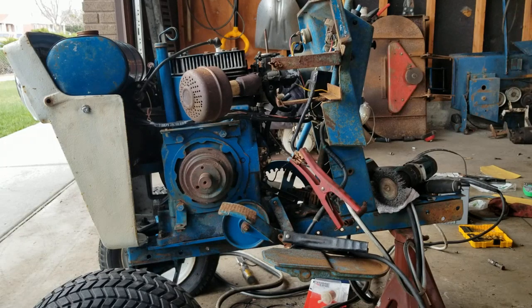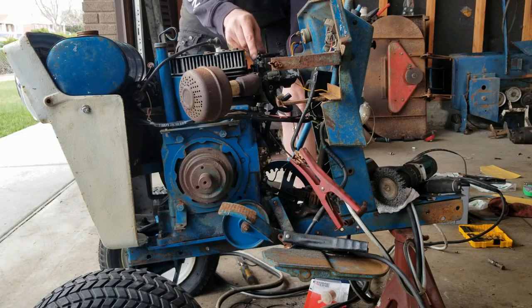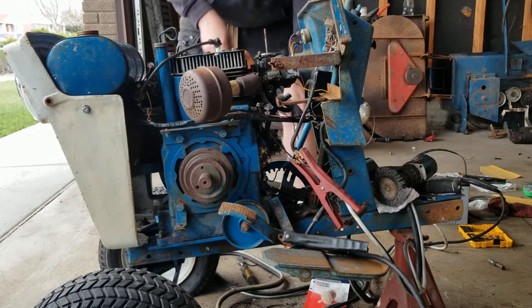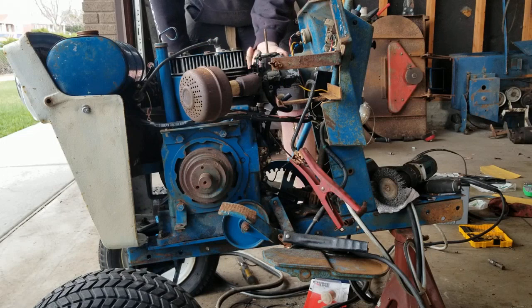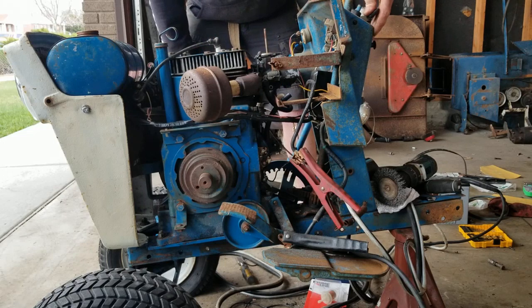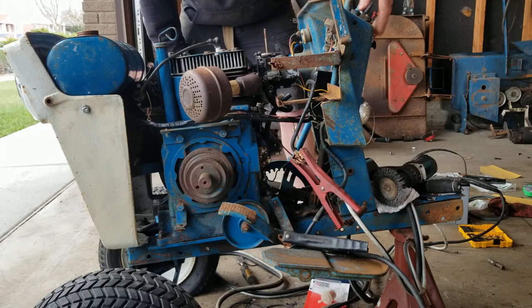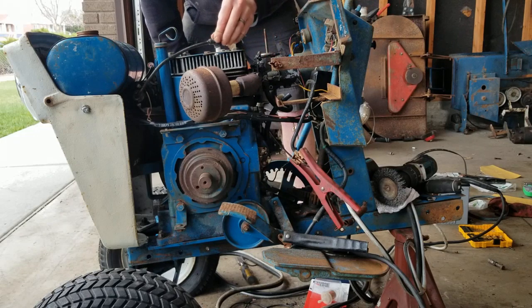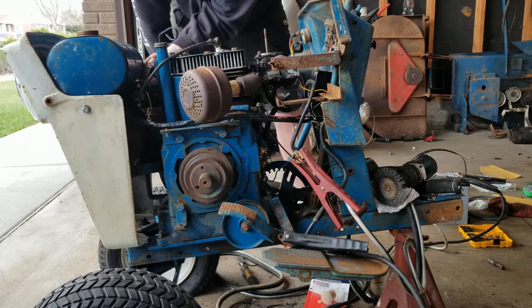Okay, hopefully this starts. We've done two turns back on the idle, two turns back on the throttle. I did a temporary pin job. My choke is currently seized, so I have to manually control that. And my throttle, you really gotta adjust that once it's running. Figure out my spring for my governor. So I'm gonna just go ahead and turn on the fuel.